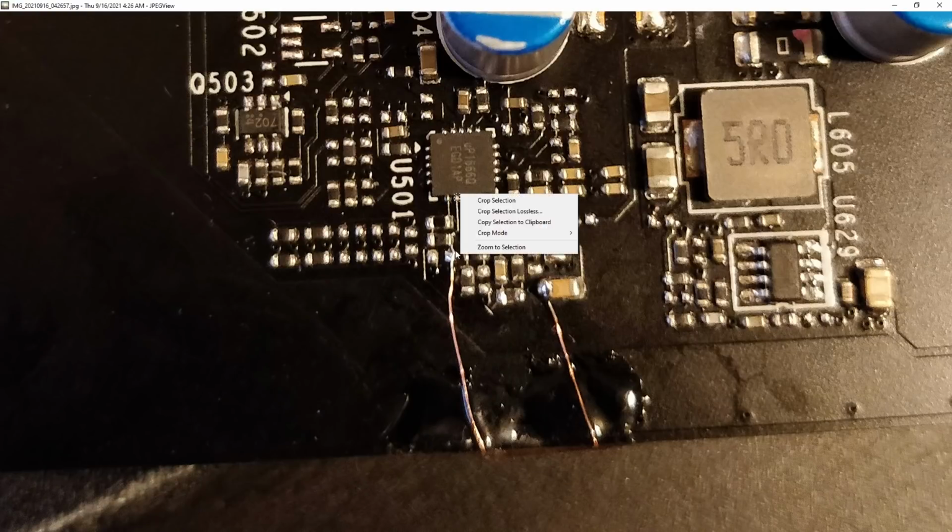So obviously ref in is connected to these components over here. The wire that I'm using is 0.1 millimeter solderable enamel wire. This stuff is really cool. It's enamel coated wire, but unlike other enamels that I have experience with, you can solder through this stuff. Just the heat of the soldering iron is enough to break down the enamel, so you don't have to strip it or anything.